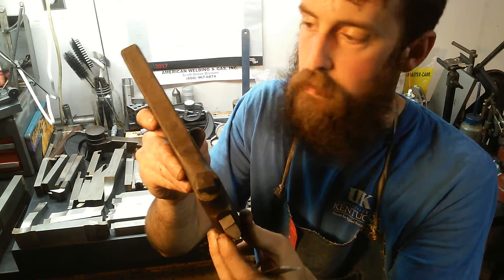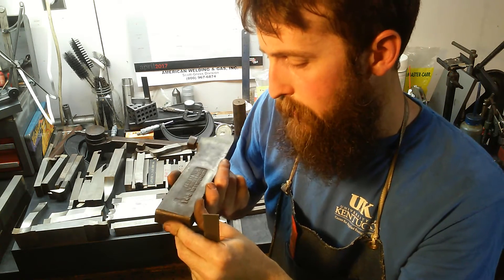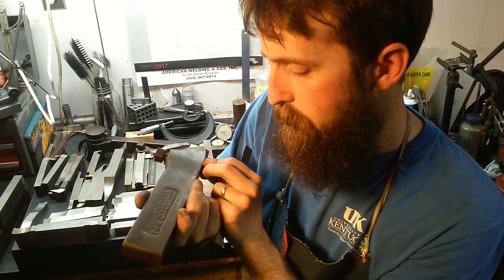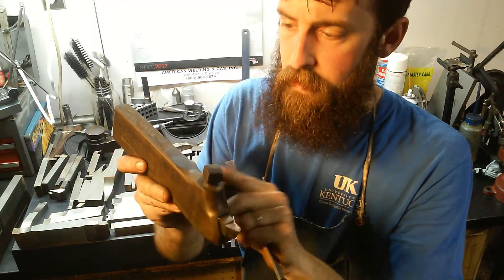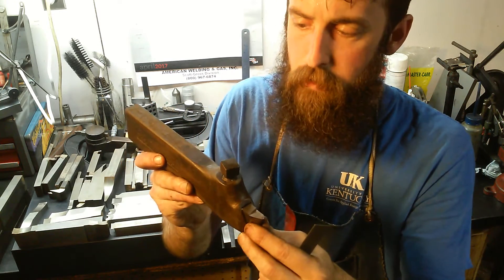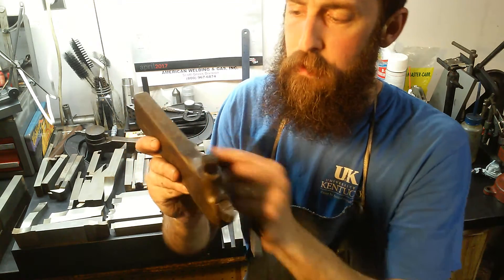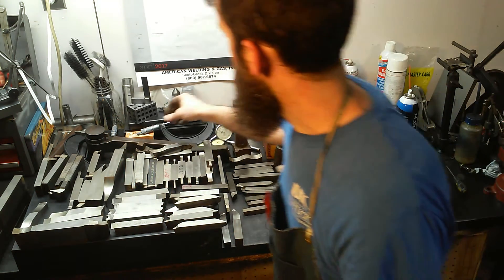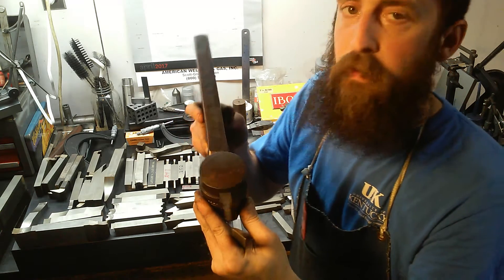A half-inch Armstrong — it's a T4S, I believe. Armstrong tungsten carbide patented tool holder, and it holds a half-inch blank. This is a good size for the shaper — it's smaller than the others and more realistic for most of the things I do. It'll bring your cutter down, so if you've got a part that's short on the table you can extend down. These are fairly robust — you don't get a lot of chatter with them. They're quite stiff. Another thing is they bring you down on the table where you don't have to crank it up so high.